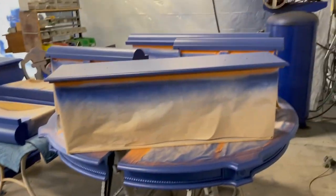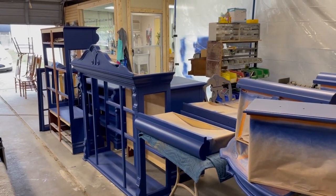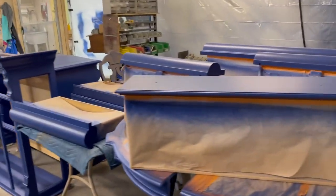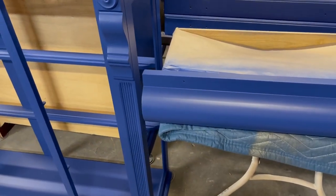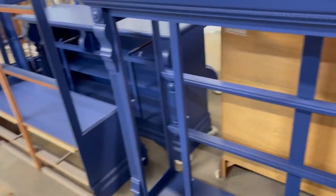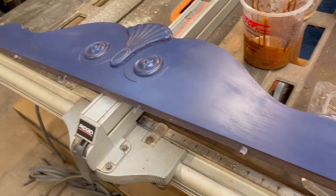This is a huge job we've got in the shop right now — probably five or six pieces: a big old china hutch, buffet, a couple of curio cabinets. It's not going to stay this color. We painted it blue and then we're applying the brown Renner powder glaze over it, and then we'll clear coat it at the end for a nice finished look. We did a test clear coat — it comes out a little bit darker. We'll show you the finished product next week when we wrap it up.